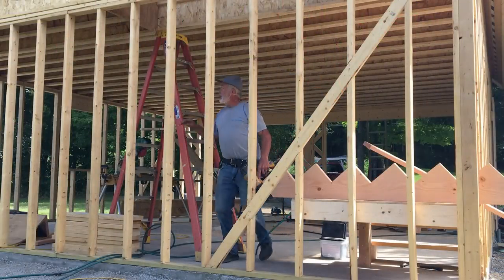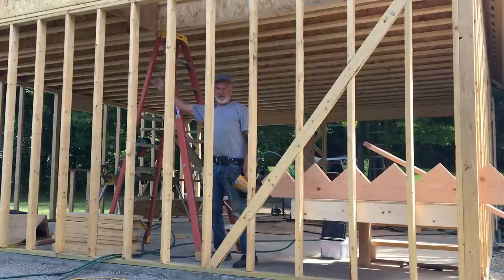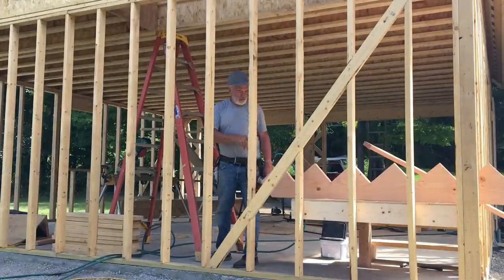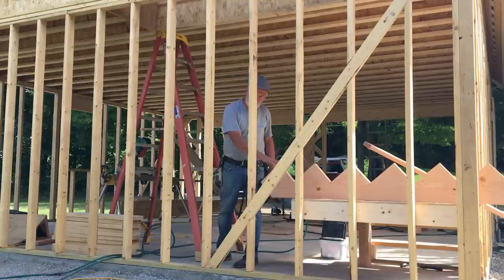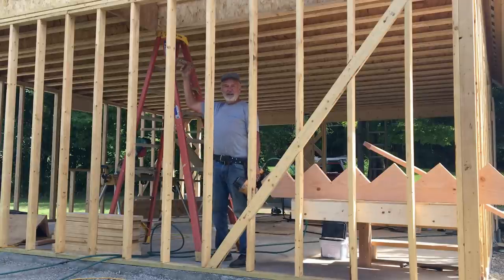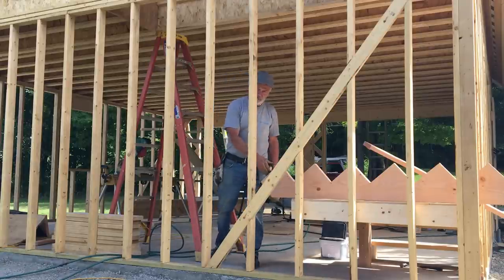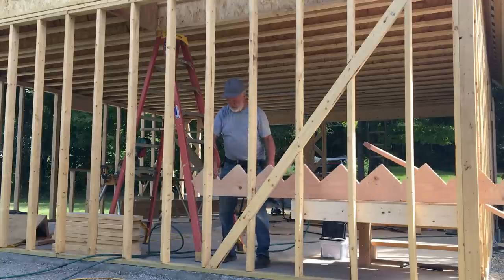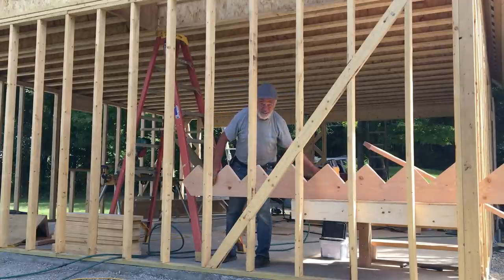All right, so we put in the last I-joist. We headered it off, so that's all secured. Now we're going to put the stringers up. I put a measurement up. We're going with an 8-inch rise, so we had to add 1.5 inches to the top of the stringer because we don't have the stair tread on. So let's see how this goes. I've already tried it, so I know it fits.